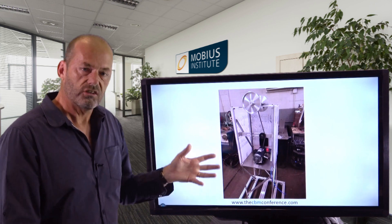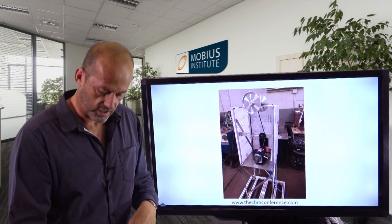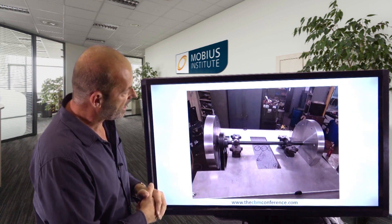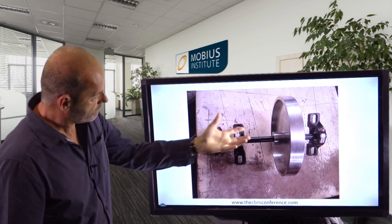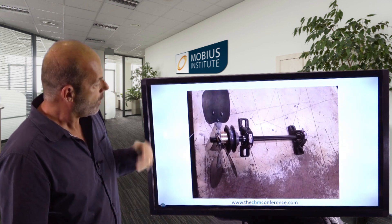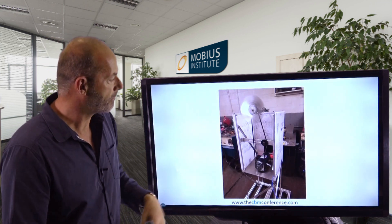As you can see, just by looking at it, the test rig is going to resonate — but we can control the stiffness and show what happens when you modify the structure. We've built various assemblies for the top of the rig: two-plane unbalance, inboard bearing unbalance, and overhung unbalance. We can also attach a fan and show some flow effects and unbalance with that as well.